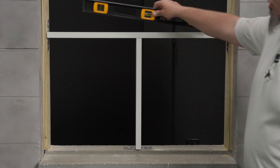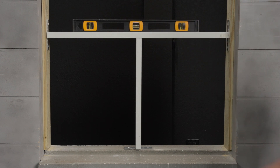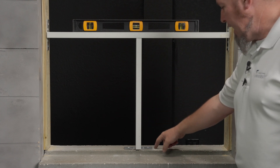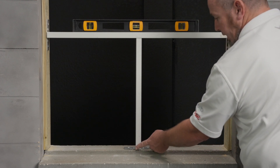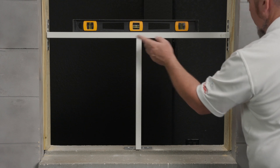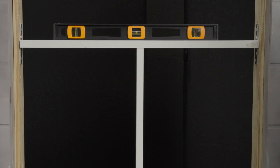My horizontal mull has been structurally anchored using the T-clips on each end and is level. The U-clip has been fastened to my horizontal mull and now I'm ready to anchor my T-clip to my pre-cast sill. I will double check that the vertical mull is flush with the leg on the pre-cast sill — it is flush with this horizontal mull, just like the horizontal mull is flush with each buck. The final step is to install my products in each opening.